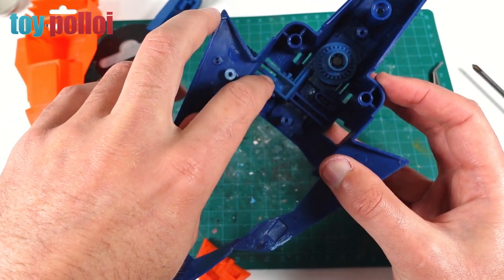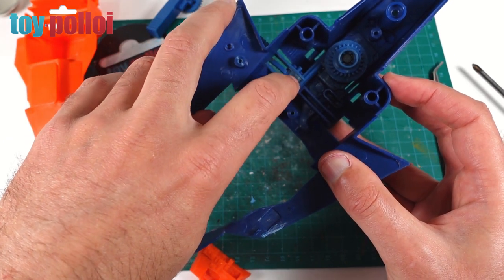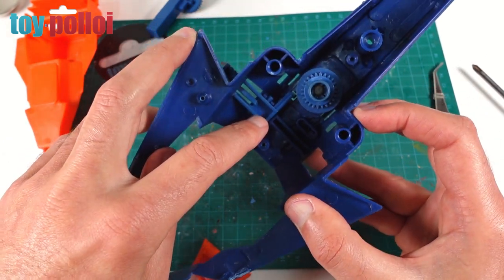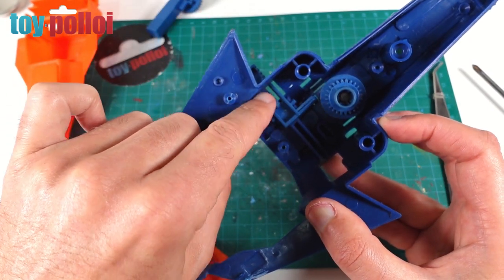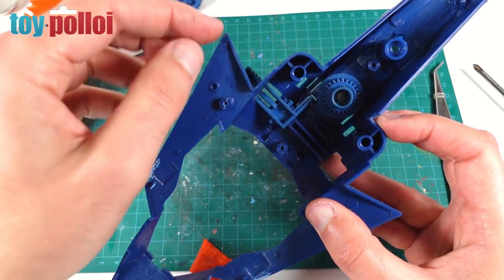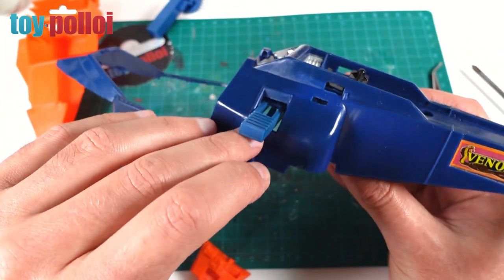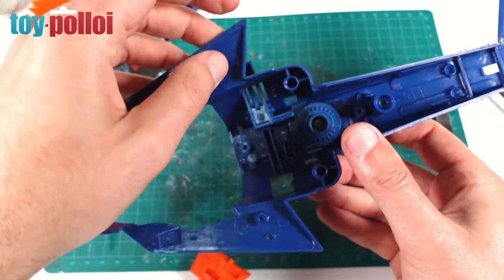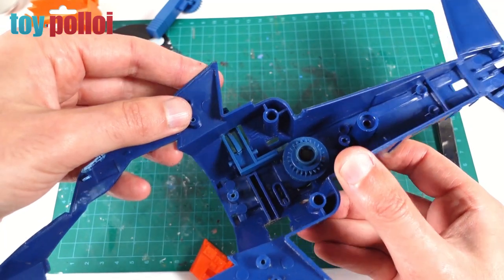I'm going to remove that broken spring, the plastic spring. There's nothing we can do about that. And I'm going to make a little panel that fits in there. And then I will attach a new spring, a proper metal spring, to that panel. And I think if we move it far enough away, it should give it enough sort of leverage to push that up. I don't think you need a particularly big spring. I think you could probably overdo that with a big spring. A small spring and a tiny little panel built in will work. So let's get constructing something to fit in there.